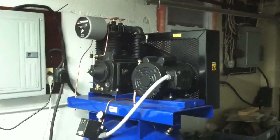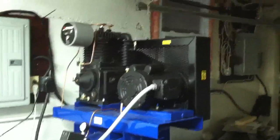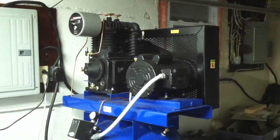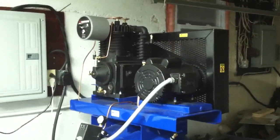A bigger air compressor runs less, and when it runs less it runs cooler. When it runs cooler there's less moisture in the air. You can see over here to the right I've got my Harbor Freight air dryer. This is all sort of temporary right now because I've still got to set up my plasma — it's in progress. Anyway, what I wanted to do was turn this on on video. I'm using an iPhone 4 and right now I'm standing about five feet away from this compressor.